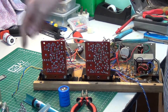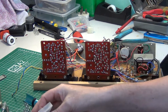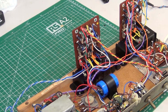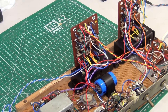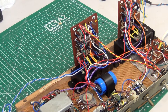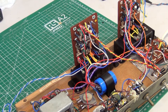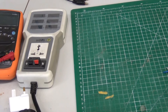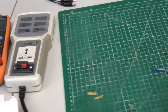It's a bit like the 2412 we're doing for the London customer — one of those amplifiers doesn't work. Mr. Chippy has done his job; all the capacitors we expected to have failed have now been replaced. What a difference with that relatively small but more powerful filter capacitor. We've got the Hoppy device ready, and we'll check current consumption. First we've got to rig it up to the loudspeakers under the bench.